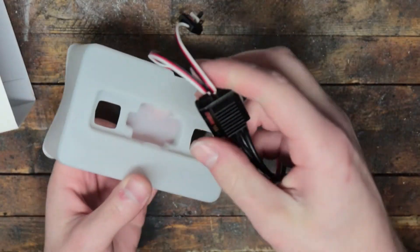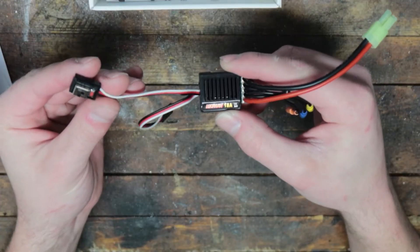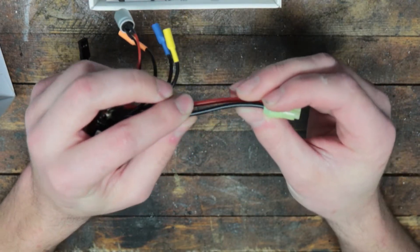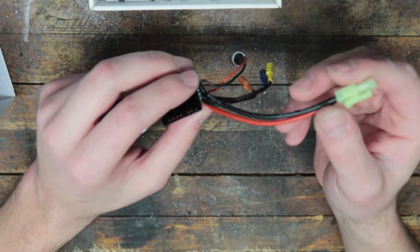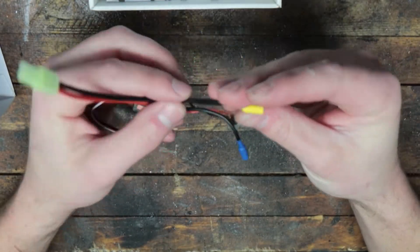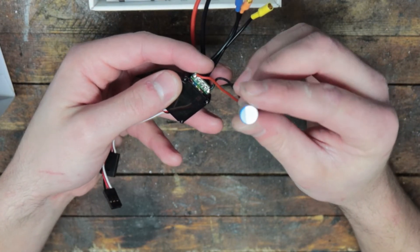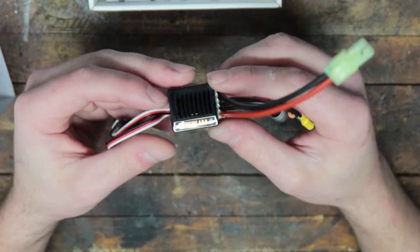Let's pull this ESC out of the packaging. We can see straight away that it's very small. On this side, we've got the power switch and your receiver connection. On this side, we've got the battery cable, which is some pretty thick wire — that's 16 wire gauge, which I think is overkill. I believe the Mini B battery is 18 gauge, and even that seems a little bit big. Then you've got your three motor wire connections — those are three and a half millimeter bullets. And you've got this capacitor, which I think is the same capacitor as all of the other brushless ESCs that Hobbywing makes.